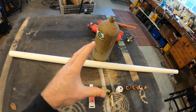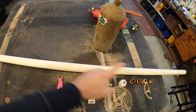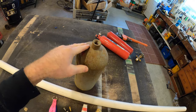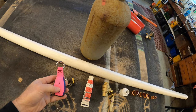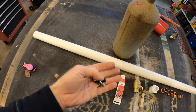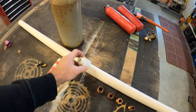So here's all the stuff I'm going to use to make this uber ball-chucking cannon. This is an inch and a half PVC for the barrel — just to direct the throw bag when it's blasting through the air. I got my tank, I think it's about two gallons, big old steel tank. You can use anything to pressurize it — fire extinguisher, you can make your own tank, whatever. I got my throw bag, I'm going to be launching these little 10-ounce guys. They fit in my tube but not too tight — a little bit of slide there. Then I got some valves — basically Schrader valves that I'll put on my tank. I got some pipe dope, the old fat ball valve, and a bunch of adapters. This will adapt to my PVC for my barrel.